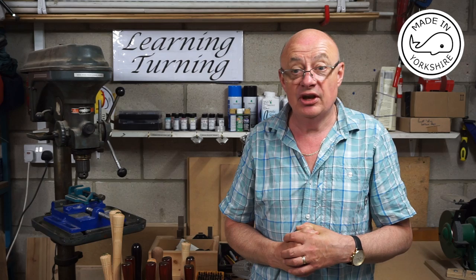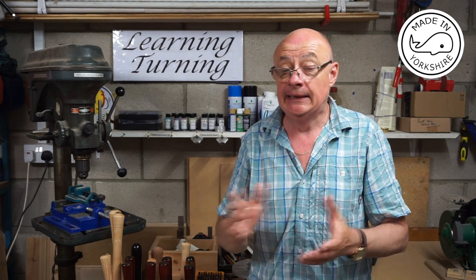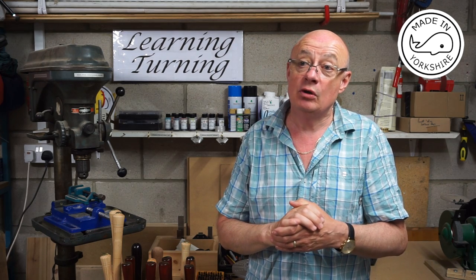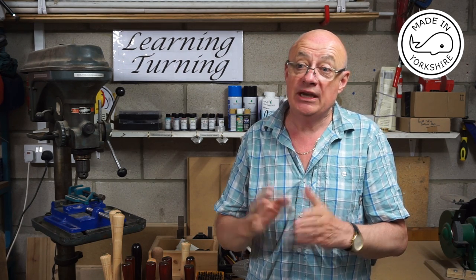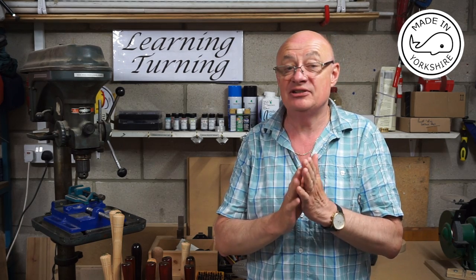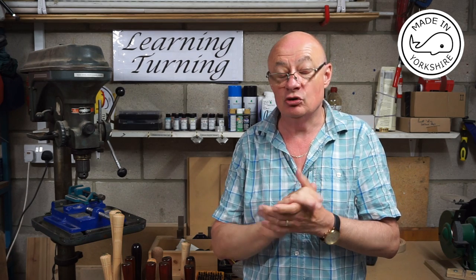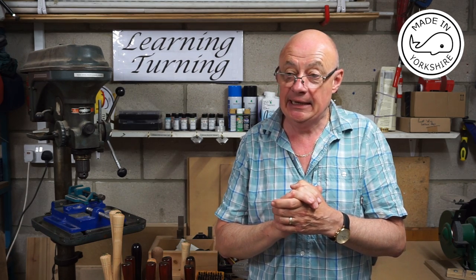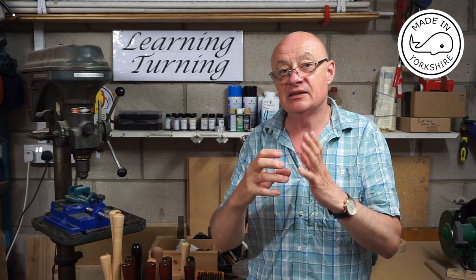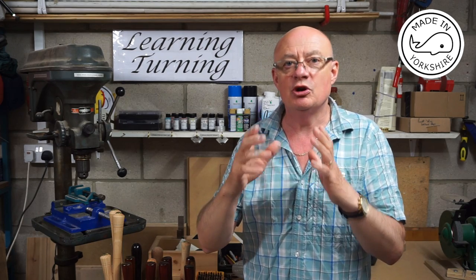Well, I've learnt that the whole process I found was quite challenging. There's a few things I would do differently. First of all, when working on the base, I think it's better to part it off when it's actually on the chuck, as opposed to taking the approach I took. Secondly, when working on the top, when it's attached to the base, put some tape around it to stop the top from spinning.